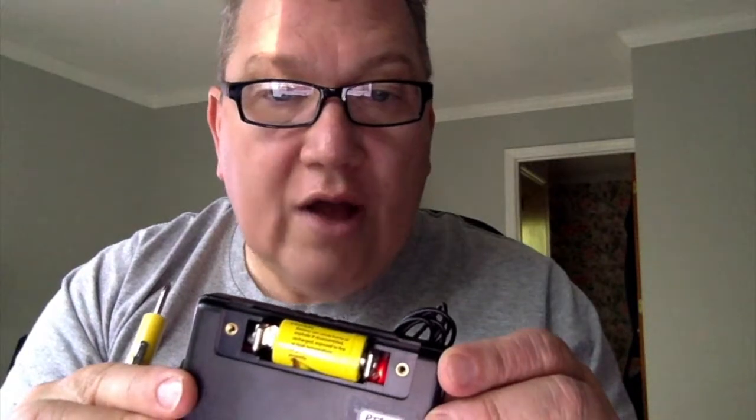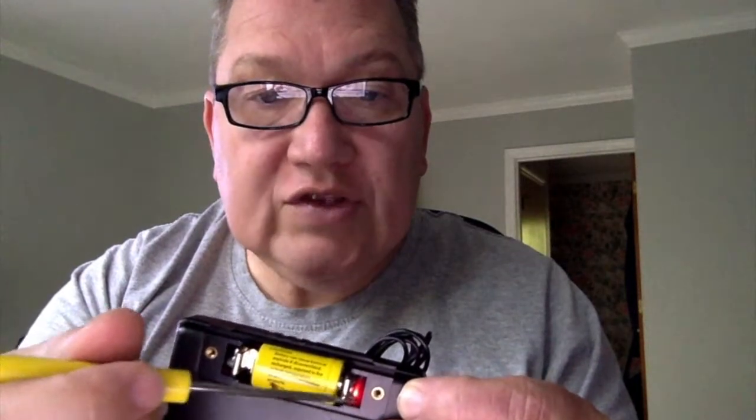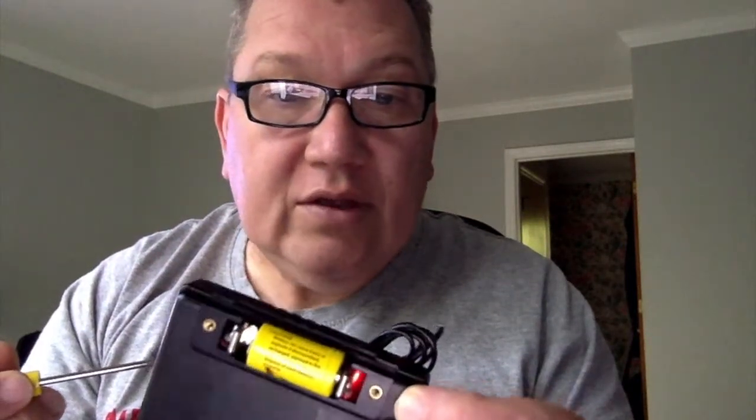And if you can see now, with the belt pack turned on and having power, you can see an LED light here. You can only really see this with the belt clip on, but this is a good first diagnostic tool to make sure you have a good battery in the belt pack.